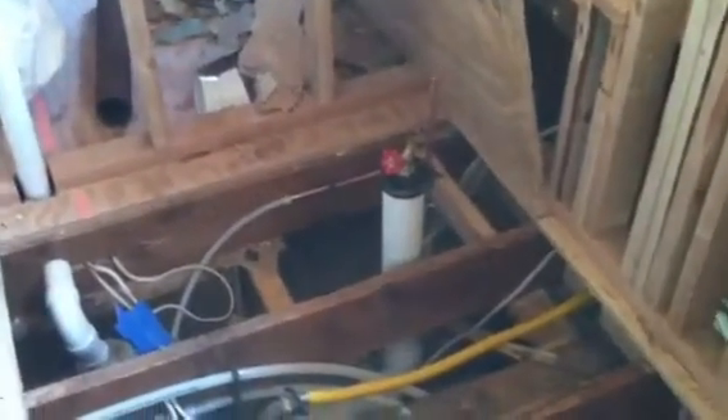And then at the end, like in this shot right over here, that's a toilet right over there, and you can see it connects into a copper where it comes out of the floor. Right in front of us, this is the sink for the hallway bathroom, and you can see where the PEX comes out of the floor and connects into a half-inch copper line, and then the copper goes to the sink.